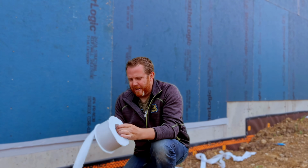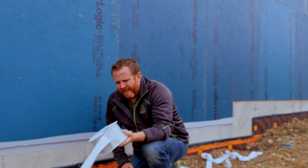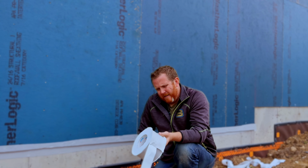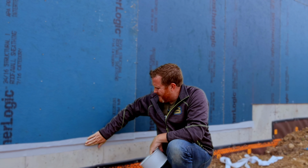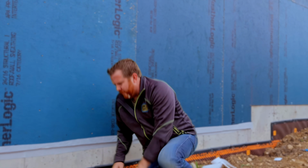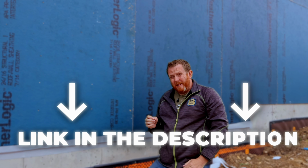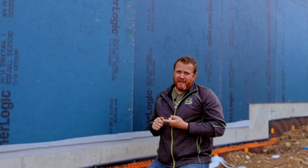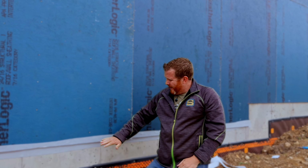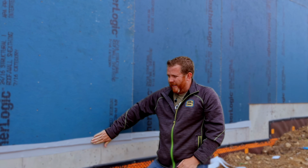You can see we hardly use any of this Fentrim. I think there's roughly 800 feet in the 4-inch roll. It also goes to 6 inches or 8, so if you need more coverage, we're going to keep going with this and go all the way around the house. There will be some links in the description with the specs of putting the Fentrim on, and how long it can last outside. It's 3 to 4 months. You want to get that covered.